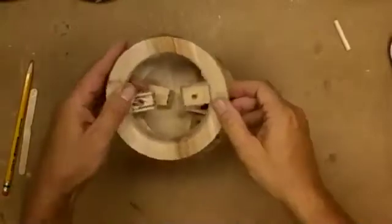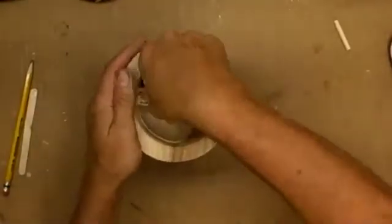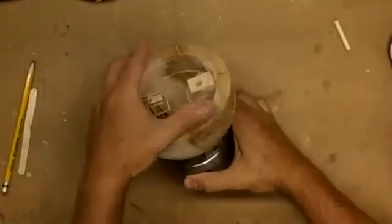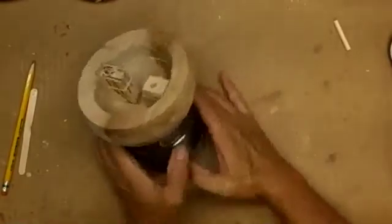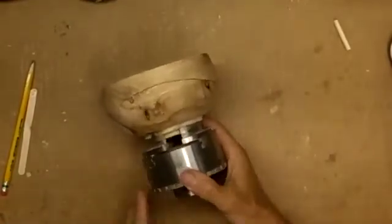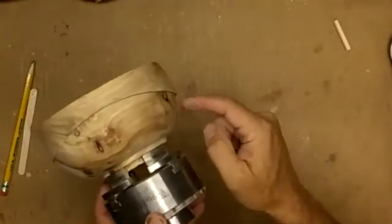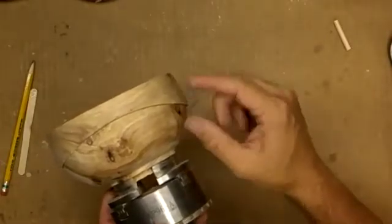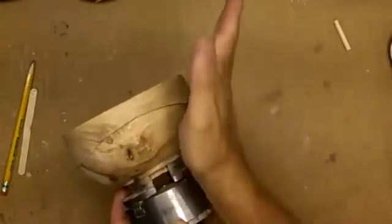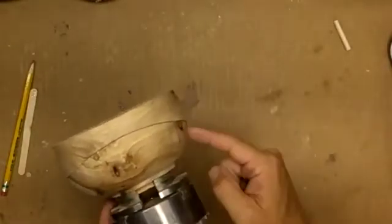So if I put a dowel here and slide this over that dowel and put this on the lathe, I can now turn this smaller. But if you look carefully over here, you'll notice that there's a shift here. This circle is bigger than here because we've taken out this space, and because of the angle of it, as this drops straight down, it makes this larger than this.